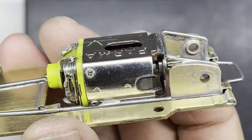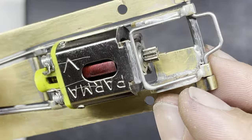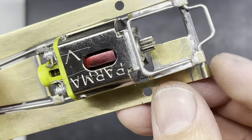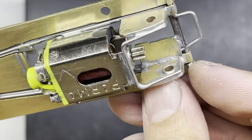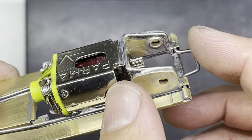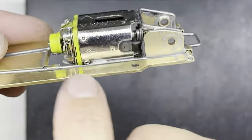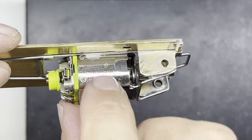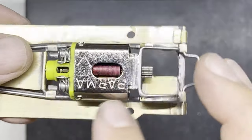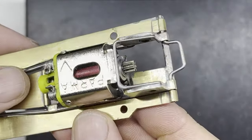So here we go, motor soldered in, bracing on. It's soldered in all the way around the back there. You can see it also ties into these little brackets at the back for the back of the pans to make them stronger. It also goes right down into the corner there to make that joint stronger. All the way over here, and again the same that side, all the way along and round. And the motor's tacked in both there and there, or soldered in there and there. So the back end is all sort of triangulated and it isn't going to go anywhere. So that should be nice and strong now.